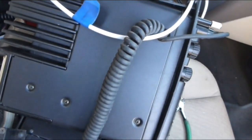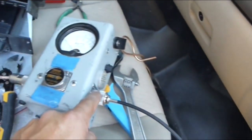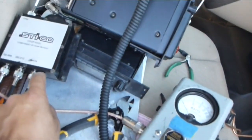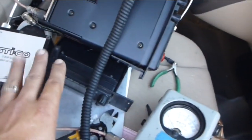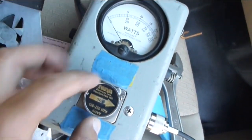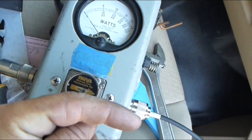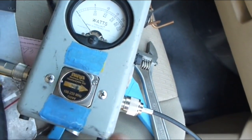The radio is rated for 50 watts — let's see what it brings. Okay, forward power: from the radio out the antenna port, into this inline watt meter, out the meter, and into the antenna system. So if there's any trouble there, this should show it. We're looking at 49 watts — that's damn good. If I turn this dial the other way, you see the transmit power going toward the antenna. Now we're going to measure the power being reflected back, just by turning this knob so the arrow points back toward the radio.